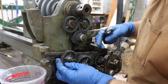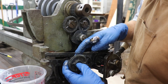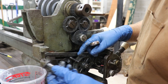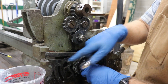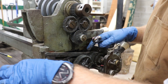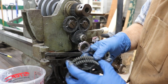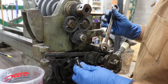This is the slide gear that you slide back and forth depending on what speed you want set. We're actually going to be adding another gear in here to drop our feed speed even lower for better surface finish — we'll do that on final reassembly. Without a quick change gearbox you'd have to change gears on the quadrant anytime you wanted to change your carriage feed speed. This is a two-gear assembly on one hub — a little stuck together, but we'll be getting all these cleaned up, re-greased, and good as new.